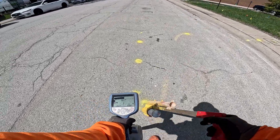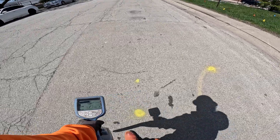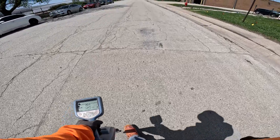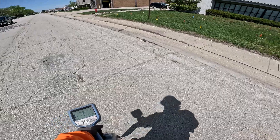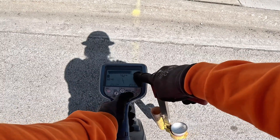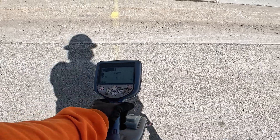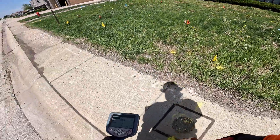I'm gonna peak it — watching my peak, watching the top bars, watching the compass. I'm watching a lot of things on my receiver. Now I'm watching the top graph bar. The top graph bar is not moving much and my compass is pointing this way, so I'm gonna walk a couple feet. I'm leaving it at 60%, sweeping to pick it up. See how strong it got — I'm too high now, so I'm bringing it down to 50%. Maybe a little up because I like to be right in the middle. I'm right in the middle now — I'm gonna dot it out.